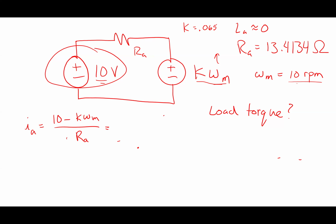Now, what's the torque? Would be the 800. Right. So the electrical torque made by this machine in steady state, the load torque is really this guy, tau M, right? We said that J d omega M by dt is equal to tau electrical minus tau mechanical. If I'm in steady state, the speed's not changing, right? Those two things balance each other, okay?